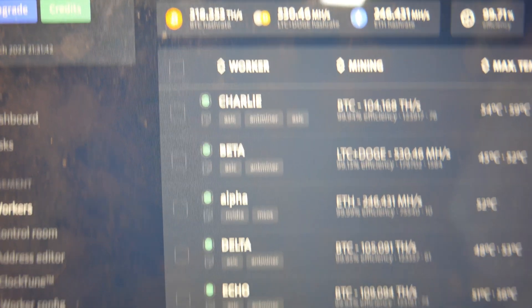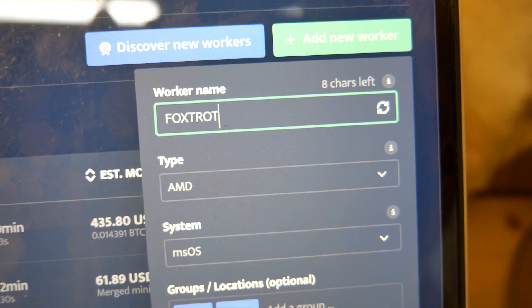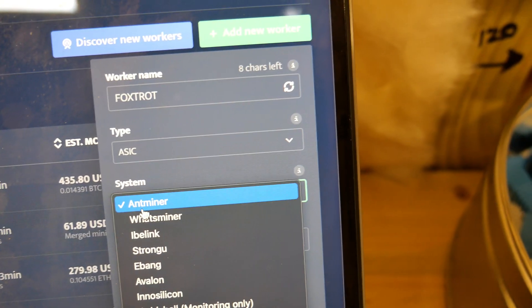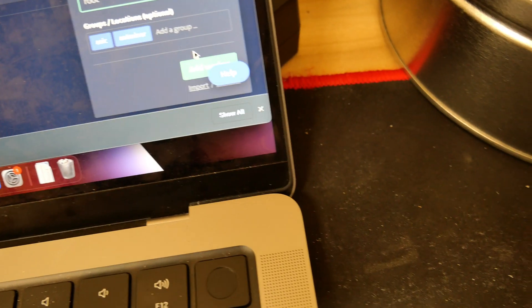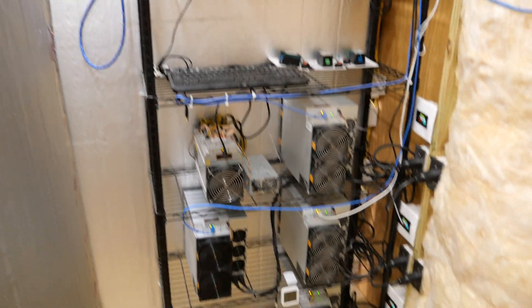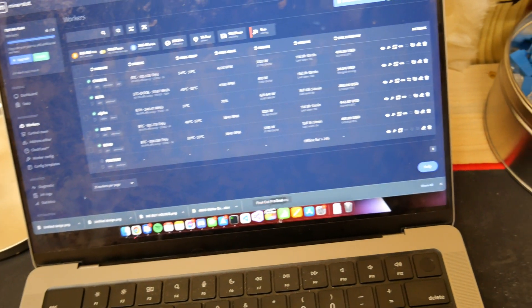I'm going to have to upgrade — all right, got that upgraded. We've now got another worker. All my names are phonetic things, so I'm going to continue that and put Foxtrot. We've got to change the type to ASIC Miner — it's an Ant Miner. We have the IP address, username and password, and we're going to add it. Those groups are important for my Raspberry Pi up here, which is a specific group that looks on the network and adds devices automatically. We should see this pop up here momentarily and come online — it might take a couple minutes.